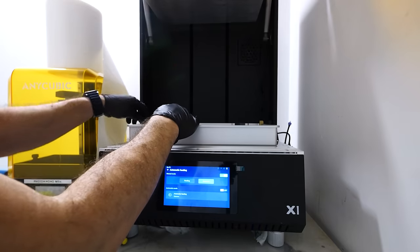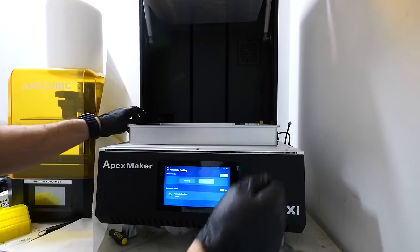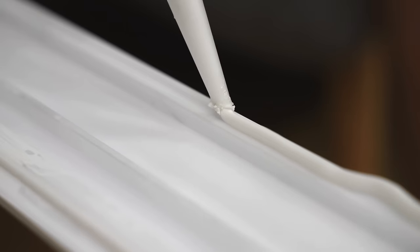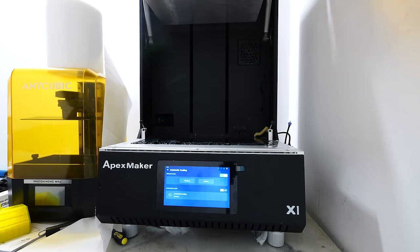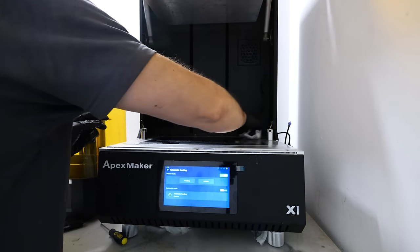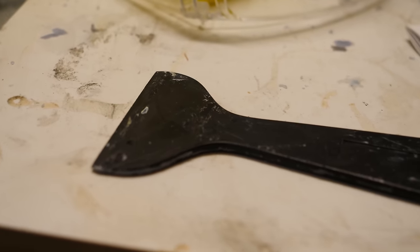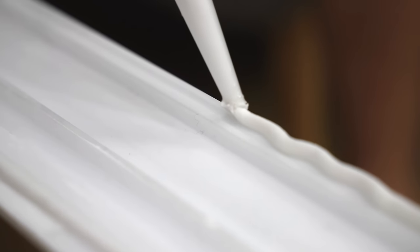It is a Kickstarter though, so if I could make one big recommendation to the Apex Maker team before they scale up production: with a vat this large, it might be a very good idea to seal the edges of the screen with something like silicone — the kind used to seal bathtubs — instead of the removable vinyl sticker they provide, because that was absolutely useless in stopping the leaking resin from getting under the screen. Even the replacement one wrinkled up after I installed it. Silicone would do a much better job protecting the printer screen, and if people needed to remove and reapply it later, they could easily do that with the provided scraper. Perhaps Apex Maker could also provide a vinyl template to protect the screen while you apply the silicone to the perimeters.